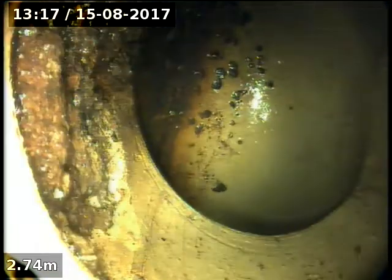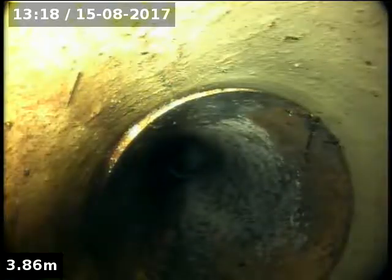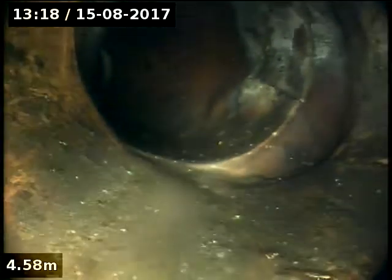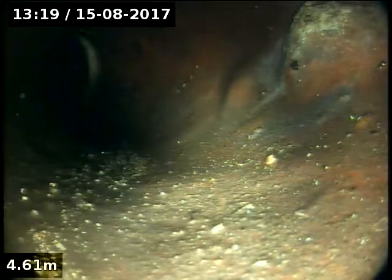Coming back, there's a junction, we'll locate that PVC to earthenware right off the start. Okay, we are located at 0.6, then we're heading right. In earthenware, it's not too bad a nick. We go a couple of metres and we get another. Oh, that's a bad join. Turning to the left, all right, we'll get a shot of that. Okay, so we're at, it says it's 1.2 here, it's turning left.